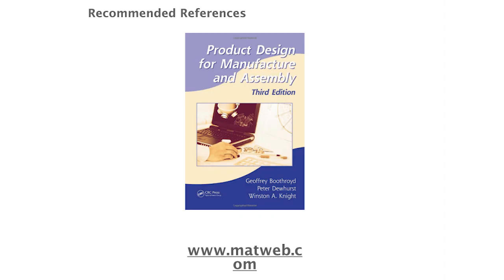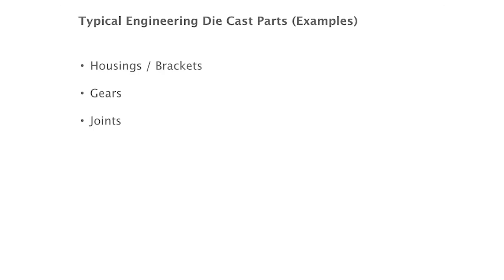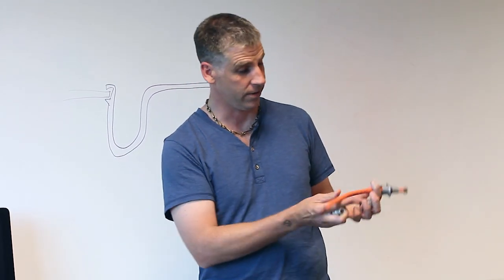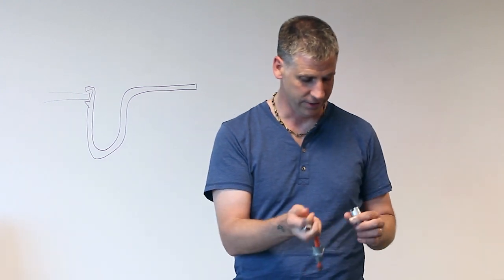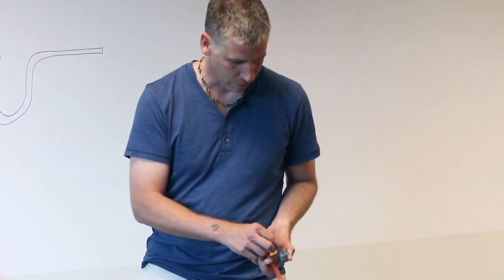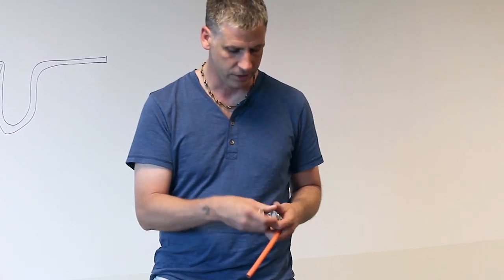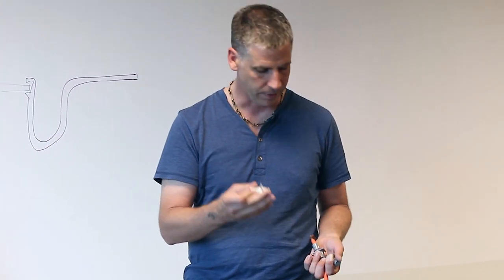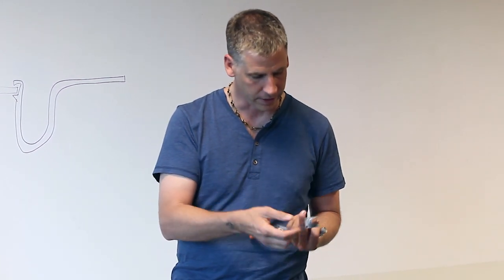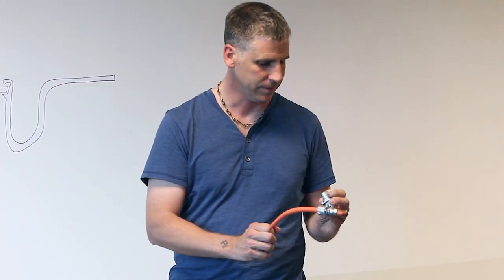So again, similar to injection molding, we've got a few example parts here that we can pass around. These three are sequential, making this connector, a kind of scary high voltage, high current connector, but you can see the different phases of the process, from just out of the tool to some sort of coating applied to it, and then they're fairly similar, and then crimped onto the cable.